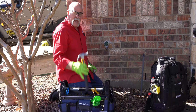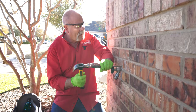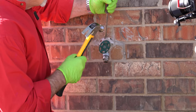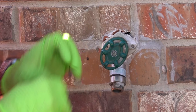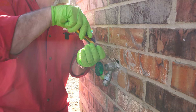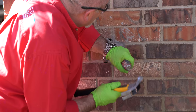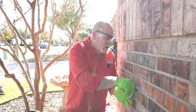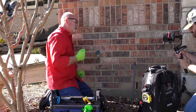I've got a couple of little chisels here. I want to take out as little of the mortar as I can. I've got gloves on, I've got safety glasses on — we're trying to do this as safe as possible. It looks like this one's been changed out before because we've got some caulk in here, not just mortar. Now we're going to go turn the water off because we're ready to get a wrench on here and unthread it. We can see it's moving around so we know we've got all the mortar off and it's loose enough to unthread. We can see that it's threaded in.